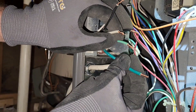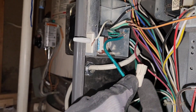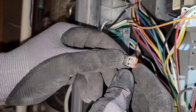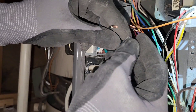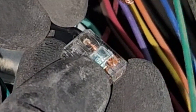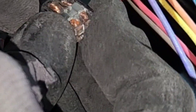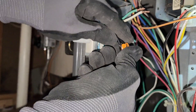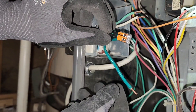I'm just going to clean these up, and now I just need to connect the greens together, the whites together, and the blacks together. Now I could use wire nuts for this, but I've had some wire nuts come off at different locations in my house, so I'm going to switch over to using these Wago connectors. They're really easy — just flip the tabs up, slide the wire in, you can see where it seats, and then clamp it down. Make sure it's seated really well and clamp it down. Tug on it to make sure it's tight. I'll put a link to a variety pack of these for different sizes in the description as well.